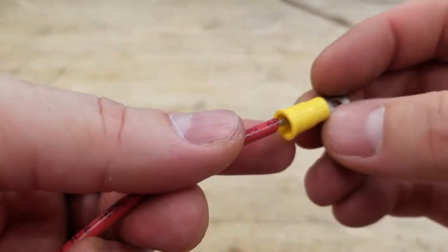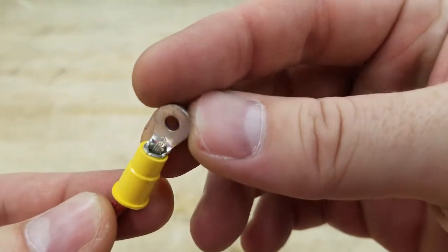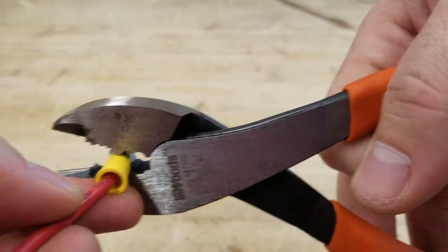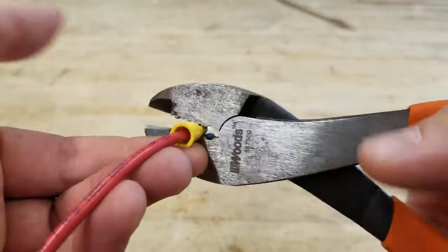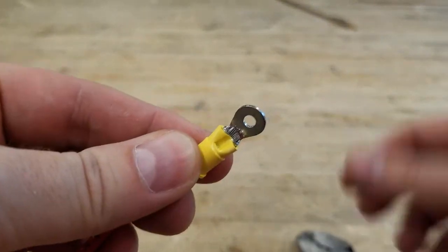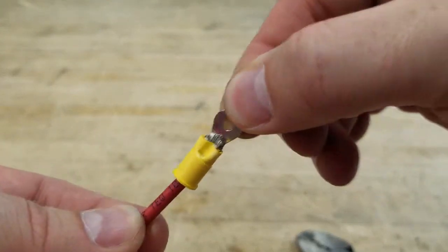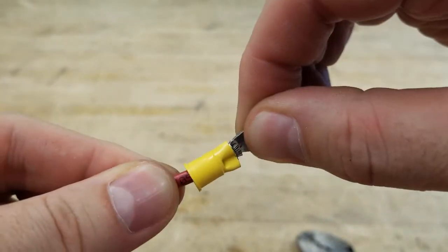Now we are putting on the ring terminal. We want to just barely see the wire coming through the hole — the point is to make metal-to-metal contact between the wire and terminal. Then take the best crimpers you can find and clamp down hard on the terminal. We will also put a link in the description below for similar crimpers. The most important step is the tug test — you need to be sure the terminal can withstand a good pull, because if it cannot withstand your forces, that wire is coming loose in the middle of a match.